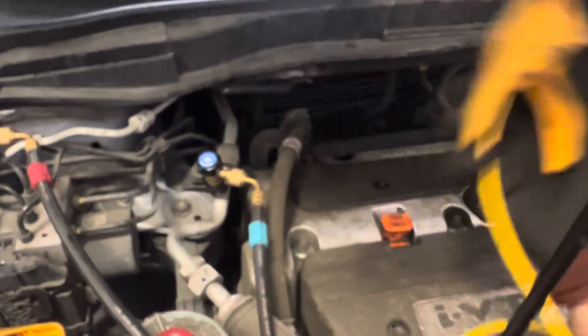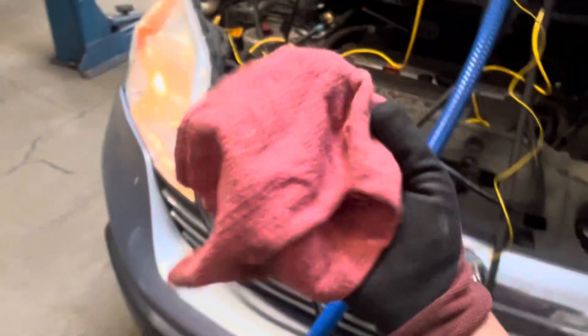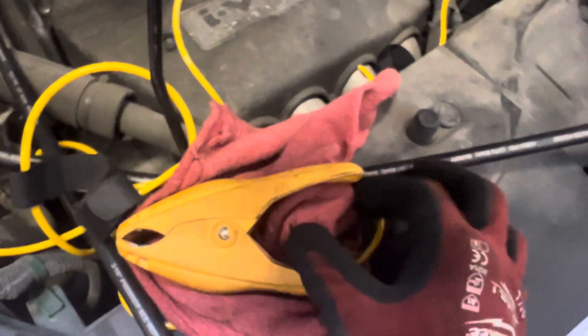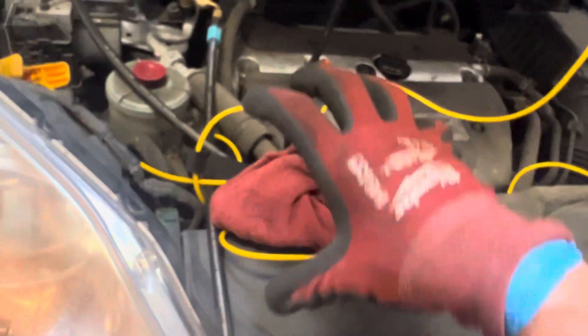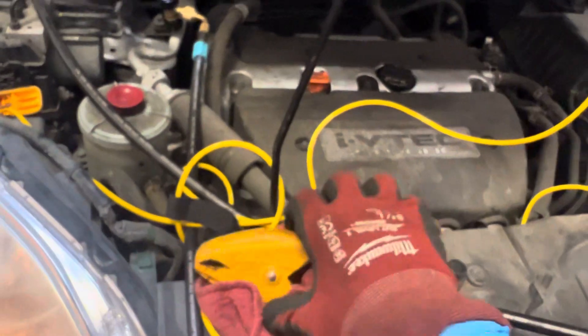So if you want detailed readings — not just general readings to confirm you have a good system — you must wrap your clamp. I like the fluffy cotton ones better, but you have to wrap them up really good and stop the air from getting down here. Wrap so air cannot blow from the backside. Put a couple wrappings on there on the cold pipe, then put aluminum foil over it with the shiny side facing out. Now you can take your most accurate readings.